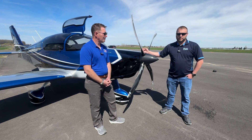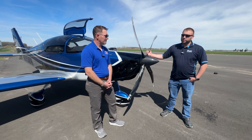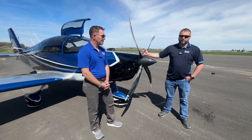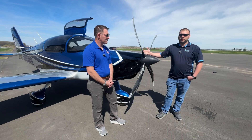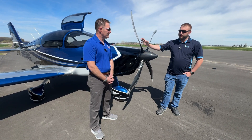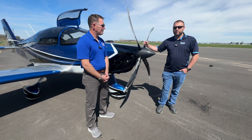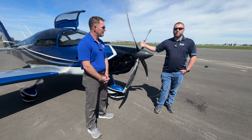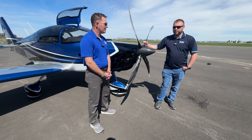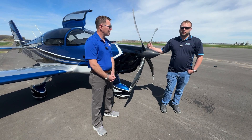Technically speaking, you should see a little bit more fuel efficiency, but the way I fly this plane I just set 75% power and leave it. For takeoff performance, it's kind of hard to do a scientific test because wind is obviously not a static thing. But looking at G3X data logs and comparing similar loading of the aircraft between fuel and passengers, what I've been able to determine is that with this propeller versus the Air Master, we're getting off the ground about 5 seconds faster, and we appear to have a rough average of 150 feet per minute improved climb rate. I've been able to demonstrate that in every single takeoff I've looked at — 10 different flights — that this is definitely getting off the ground faster than it was with the Air Master. Take that with a heavy grain of salt — it's not very scientific, but it's enough for me to say yes, there is an improvement.